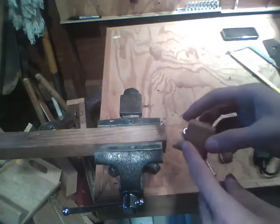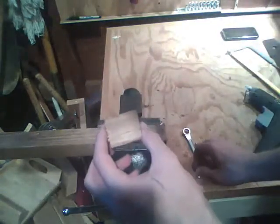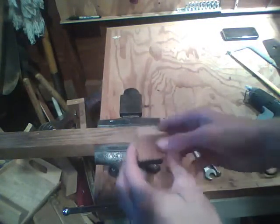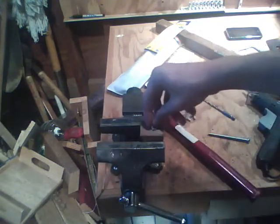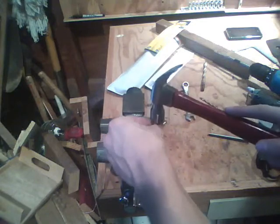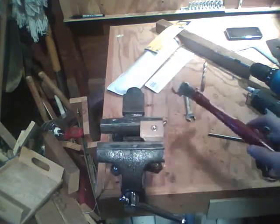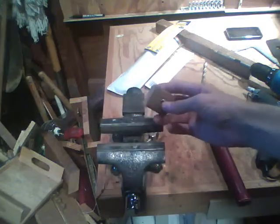Let me explain this. This is the cut I made earlier — you can see it's a curved, tapered thing, and I cut it off about an inch. I'm going to drill my 7/16ths hole into the bottom so it fits in right there. Now that I've drilled the hole, as you can see, I didn't go all the way through — just sufficiently deep so the nut could fit in. I'm going to put it back in the vise, take my nut — it doesn't quite fit in — so we're going to force it in, because force fittings are the best. I'll just take this small hammer and make it fit. So now this block will screw onto your tripod, and this is the base for your mount.